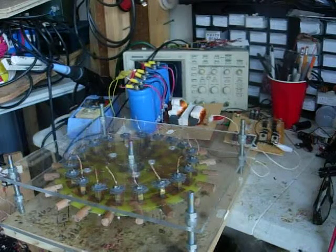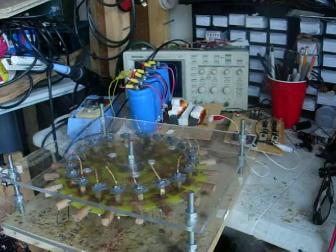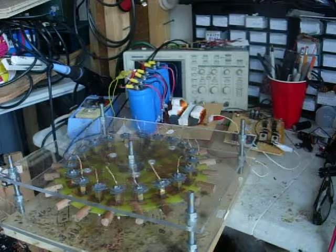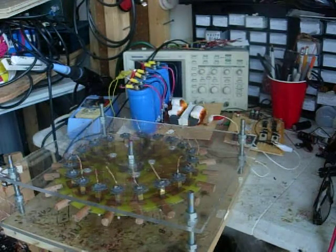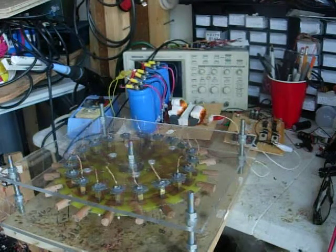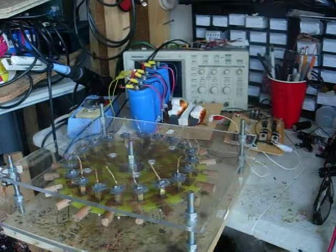So there's something interesting going on there. The ferrite core is apparently pretty efficient at whatever frequency I'm running it at. I'm seeing about 400 volts negative back EMF pulses on the primary, and eventually we're going to have a system with numerous secondaries — one running the system, starting it with a 12 volt battery, and using capacitors and FETs: a fill FET to fill the cap, and a dump FET to dump the cap to the primary.